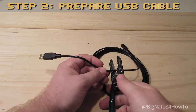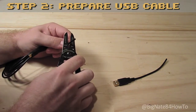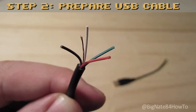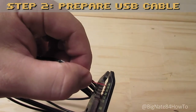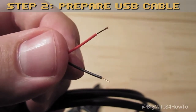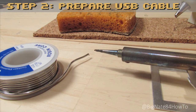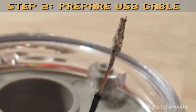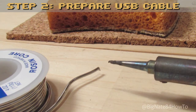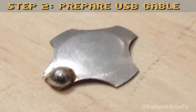Step 2: Prepare the USB cable. Identify the end of the USB cable you do not need and cut it off — just make sure you're not cutting the wrong end off. Remove three to four inches of the outer insulation with wire strippers. The red and black wires should remain intact. Remove the other wires, which will not be needed. Remove a half inch of the outer insulation for both the red and black wires, exposing the copper. Tin the exposed wires with some solder and a soldering iron. Tinning the red wire will keep it from coming apart over time and possibly shorting out against the outer wall of the bottom battery. Tinning the black wire will prepare it for being soldered to the detent later on. While the soldering iron is still hot, tin the detent. Be careful not to get the detent too hot because it could be damaged and lose its spring. Solder a little bead of solder to the outermost edge so that the middle of the detent is not disturbed.